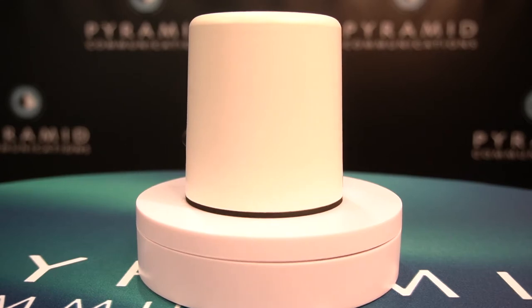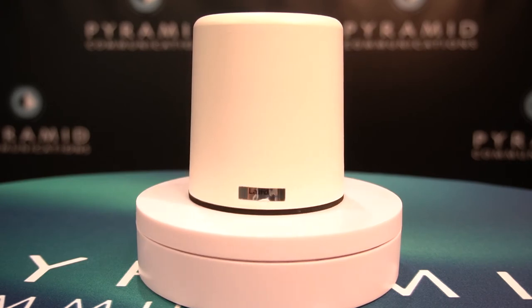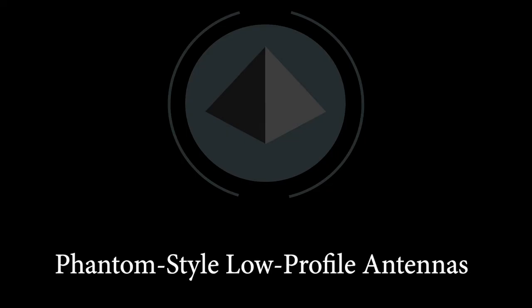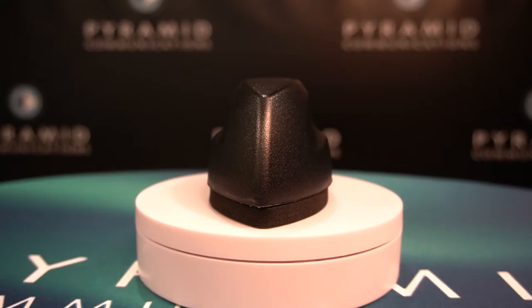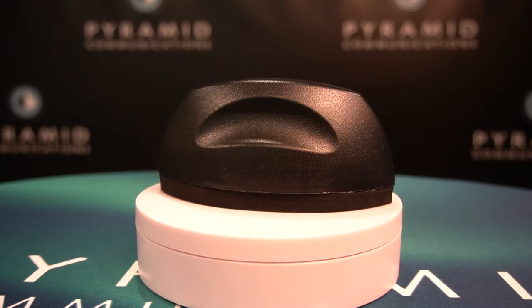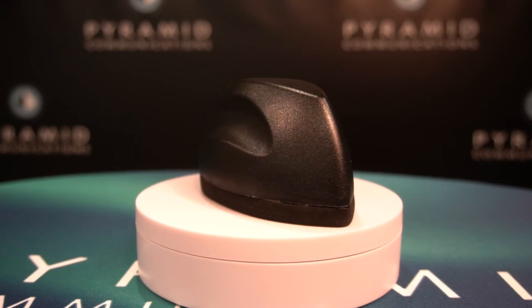The first option is the soup-can style antenna — it's a low-profile antenna in the VHF band; they also make them in UHF, 700, and 800 MHz. It's a nice-sized antenna that will prevent coupling between the mobile radio high-power transmitter and the Pyramid receiver. Here's another option — a phantom-style low-profile antenna that will aid in isolation between the vehicular repeater and the mobile radio. The nice thing about phantom antennas is that they have a very narrow bandwidth, so they act like a band-pass filter, preventing out-of-band interference or energy transmitted by the mobile radio from getting into the Pyramid antenna and coming down the coax, which could overload the front end and cause desensitization.